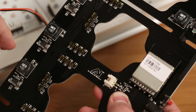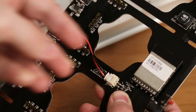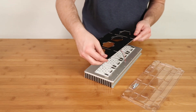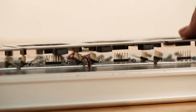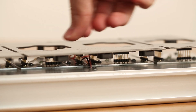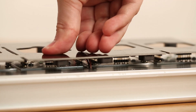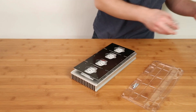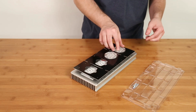Connect the fan cable to the main board. Attach the circuit board to the LED pucks by aligning the pins and pressing evenly downward. Place the lenses atop the LEDs, making sure the lenses are aligned and seated properly.